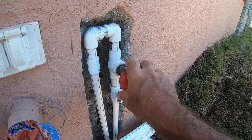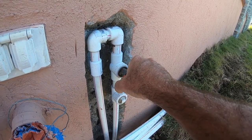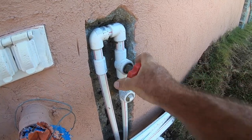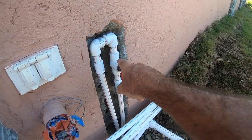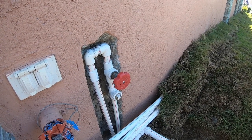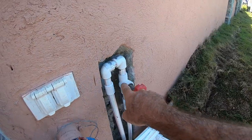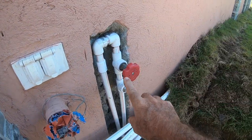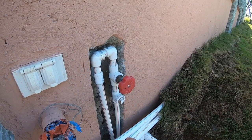It takes forever, with a huge amount of pressure tightness that you have to turn, to get the water to shut off. So it's possible that one of the components, maybe the gasket or the O-ring inside, is bad. It's possible that this was put in incorrectly. I don't know. These types of valves actually have an input and an output.